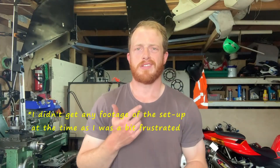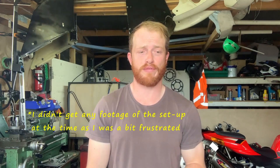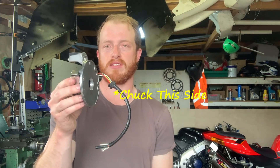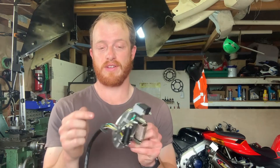There is no way of holding this in the lathe without a great deal of faff. This piece here will always hit the cross slide because it needs to be mounted this way, and I can't get the compound slide across far enough to machine in here. So we're going to do what I couldn't be bothered doing. I always harp on about being lazy, but we're going to crank out the boring head and use that for the first time. I'll just be controlling that manually and we'll see how we go.